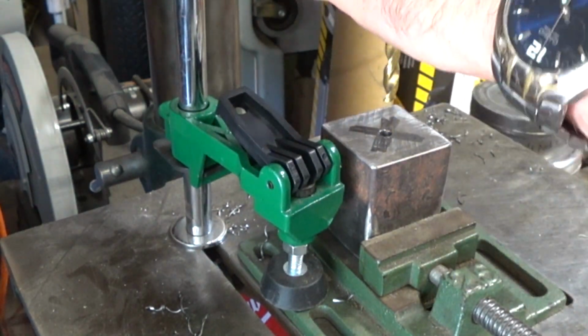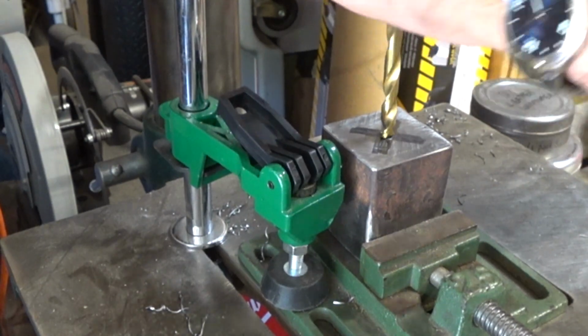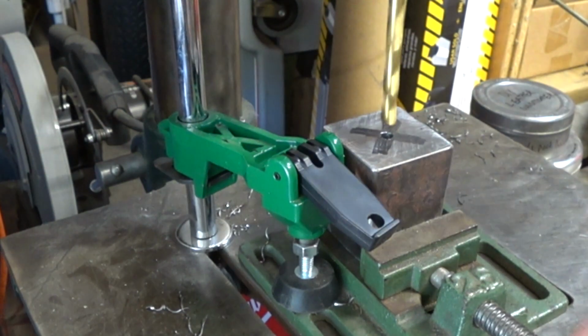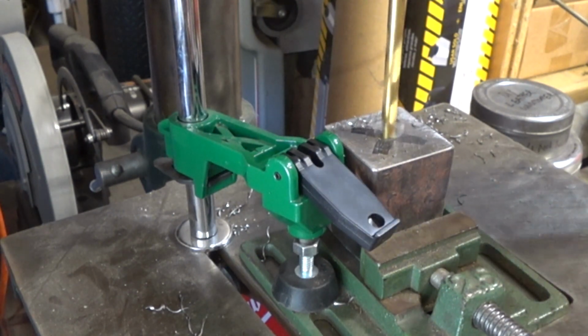It's worth noting that even though these clips appear to be in real time when I'm doing the drilling, they're also sped up to reduce the tedium. So keep that in mind, that you want to actually run your drill bits very slow, and you want this process to be done slowly and carefully.